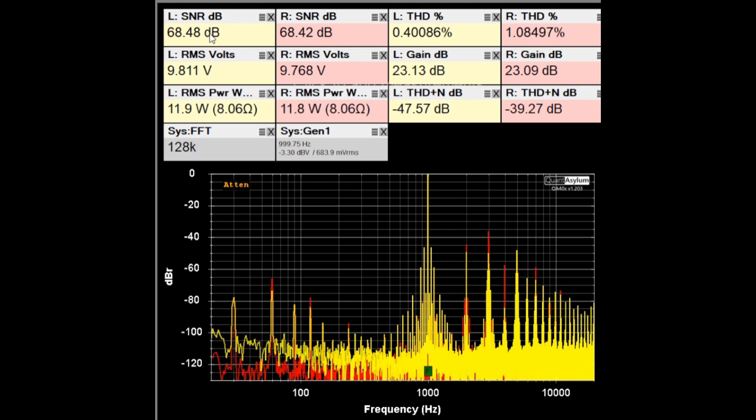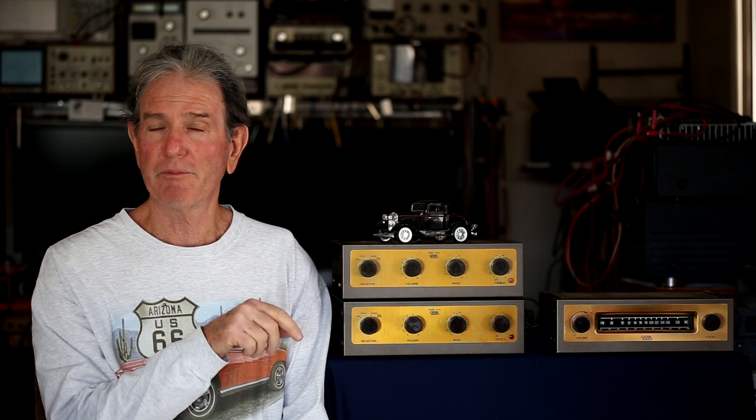One of the HF-12's on/off switches on the treble control was opened up — they shorted the input to the output so that amplifier is always on. The workaround was to plug that amplifier into the switched AC outlet of the other. The person who did the work actually painted both the power cord and the AC socket in scarlet paint to make sure you'd connect them correctly, and labeled one as 'master' and one as 'slave' as you saw on the tour. To me that was a good, practical solution.